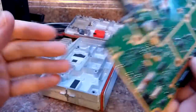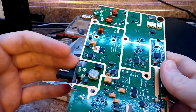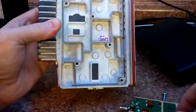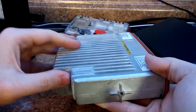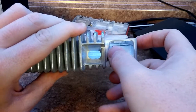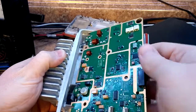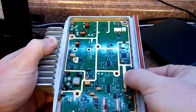I've done a lot of modification on them as well. This is a great little radio — shielded right out of the box. It will very reliably do somewhere around half its rated power for extended 24-hour key-downs. It's got great heat sinking — you can see the thermal pads on there. I like to mount it like this so the heat radiates up. You can put a little muffin fan on here, and I've seen people pull logic lines out because there are programmable logic outputs. You can actually control it with DTMF signaling if you have the DTMF option board — so it's very programmable.